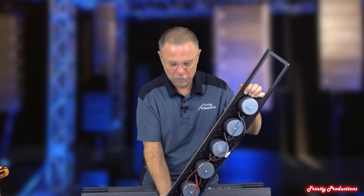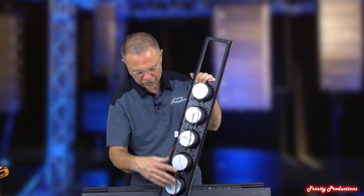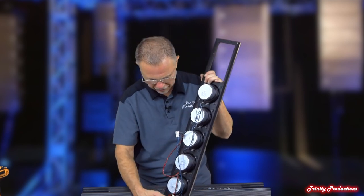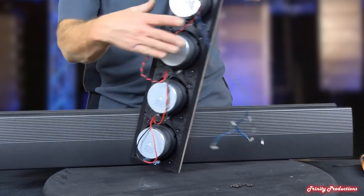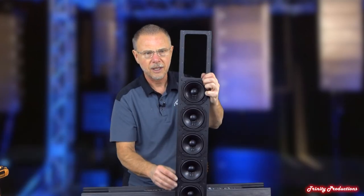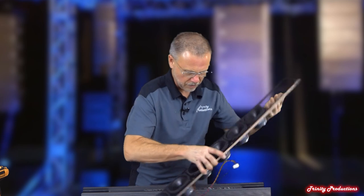So we're going to go ahead and pull some more screws out, pull this sub-assembly off that has all the speakers on it, and get into this FBT CLA 604A. We've got the back plane out and the front plane here with the speakers in it. This is probably one of the most involved disassemblies I've ever done — they've put this thing together with surgical precision. Here are the six drivers on two different amplifiers, indicated by two different colors of cord, and then there's a little cord for the high-frequency drivers. They are all mounted on about a three-eighths inch piece of multi-ply, and they are all on thread certs so if the drivers ever need to be replaced, you can take the screws out and replace a driver without worrying about stripping the wood.